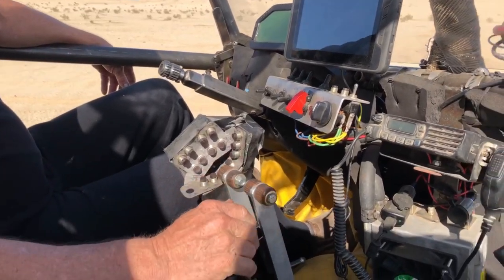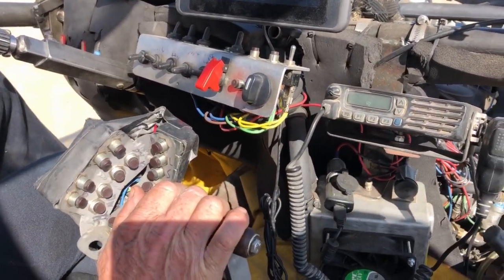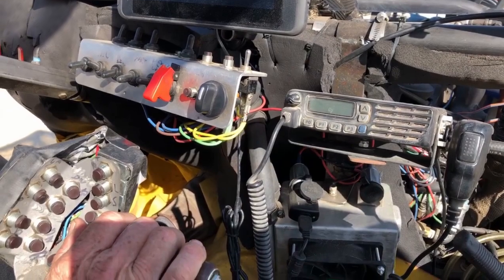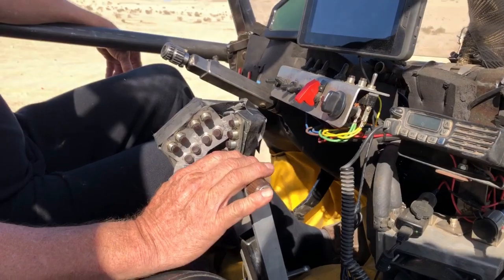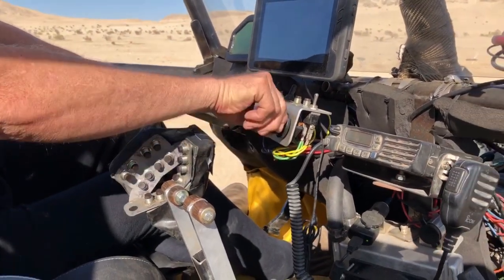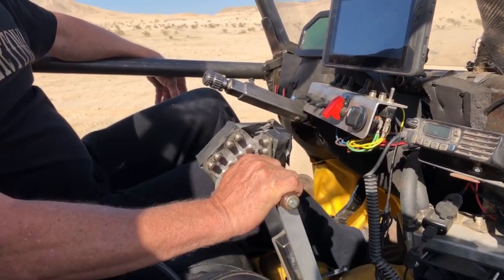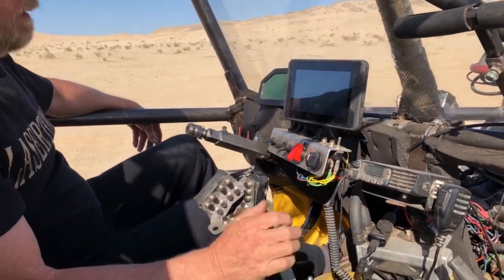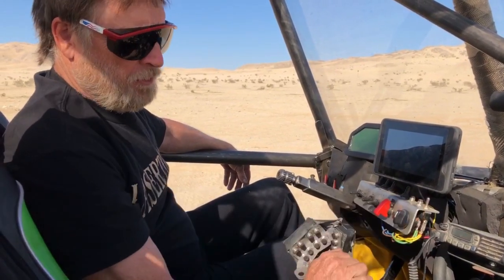Okay, the throttle on this car: I've got a standard accelerator pedal down there. On roXdawg's, which was a hydrostat car, because you need constant torque, I had a governor on it and a rheostat, so I could turn the RPM of the engine up and down and the governor would maintain it. On this car, I'm just using my foot to do that right now, but I believe I will probably wind up with a governor in this car. I like the way that worked, with a rheostat I can just set the RPM at 2500 or wherever I want it, and the governor will maintain that.